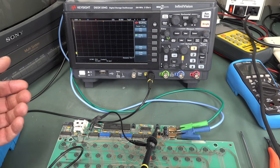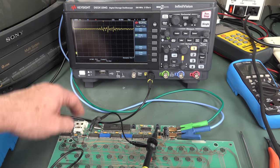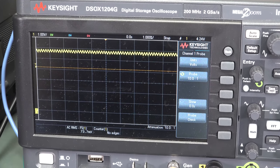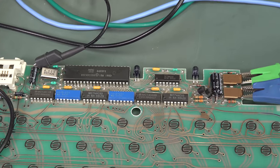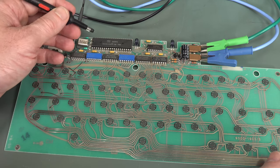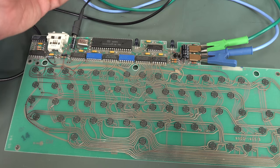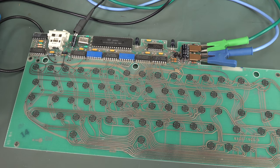I don't know what the deal is, and I'm getting no signal on the keyboard lines either. We get this little wiggly signal on the power rail. But at one microsecond per division, count the rough number of cycles — there's six. Six megahertz. That's just lack of bypassing on the rail. Apart from the 400 kilohertz on one pin, there is absolutely no activity on any other pin on that micro. I've checked every pin while activating a button. There's no scanning, there's nothing. Just the 6 MHz clock and that 400 kHz signal on one pin.